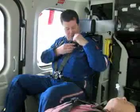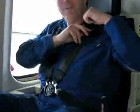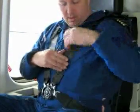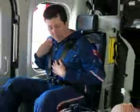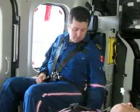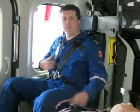Same thing applies for the shoulder harness. You pull on this tab here, that'll loosen it. It's as loose as it'll go for myself. And you can also tighten it up. As I mentioned, the shoulder harnesses are on an inertia reel. You can also lock the inertia reel. There's a small knob under my left thigh, underneath the seat. Flip that forward. Shoulder harness is now locked.